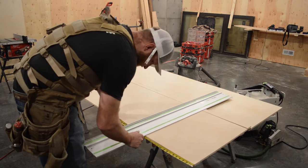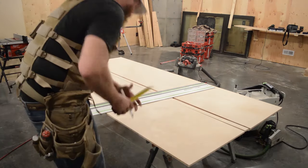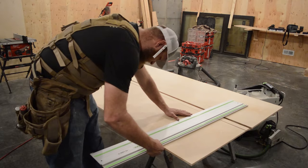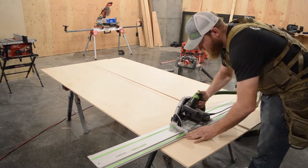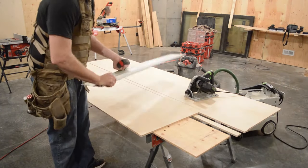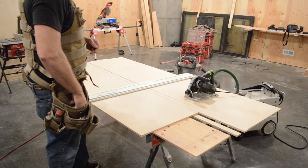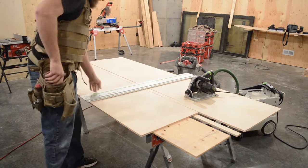To make this process as simple as possible, I have two different size boxes: a 16 inch by 16 inch box on the bottom and on the top, with five 12 inch boxes in between them. This is a very large organizer — it's going to take almost eight sheets of plywood to build. But you can adjust the style of this organizer to fit any space that you have.